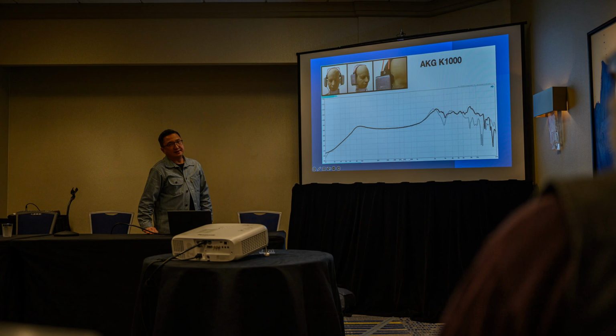Now the cool thing about the 5128 that I neglected to mention, I forgot, there's no measurement reference plane because of how they calculated the transfer impedance, the input transfer impedance of the canals and the drum separately. And then if you read the studies, you'll see they use one to corroborate the other. And so you have at any point in the canal, from canal entrance all the way to the drum, an accurate measurement.